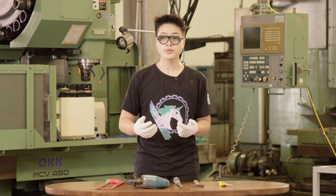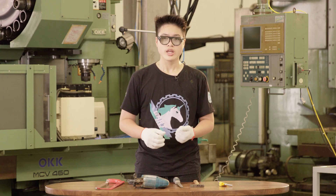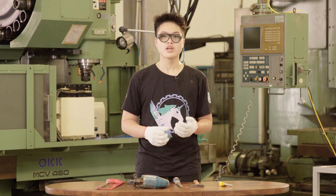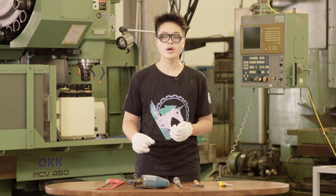In conclusion, there are three manufacturing methods to remember: manual, CNC, and 3D printer. Manual is the easiest, cheapest, and fastest way — good for making parts that don't require high accuracy where errors don't matter. CNC is the most expensive but delivers the best quality, and is highly recommended when you need parts that are solid, dense, and require high accuracy. Finally, the 3D printer is great for making small, accurate parts if you have good enough filaments.